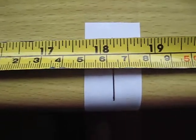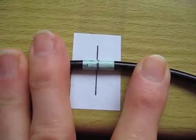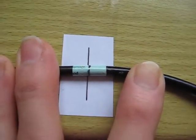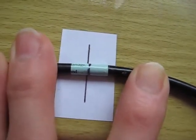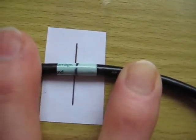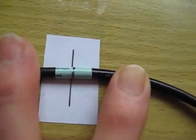Or as near as you can. Mark a sticky label, wrap it round — your first part of measuring. Mark it like that, and then stretch the coax out to the right to your next mark. Two fingers like this — without holding a camera — hold it firmly down, and with your sticky label positioned around the coax in the right place, mark it with the pen. Do that twice, so you will end up with three of these, at 463mm apart.